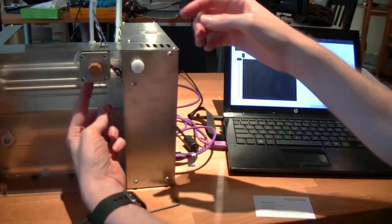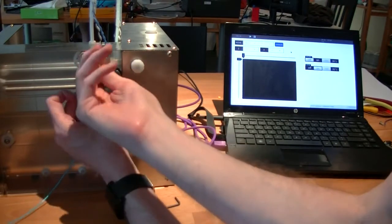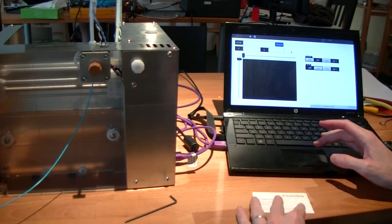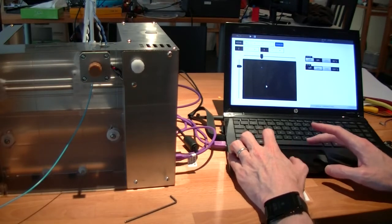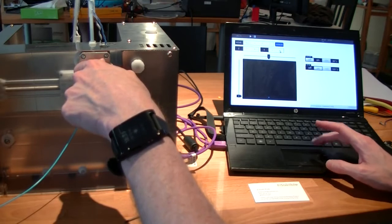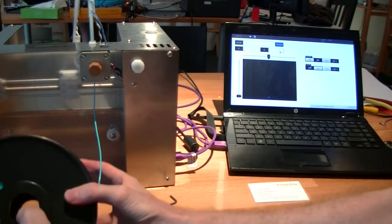And then what you're going to do is the opening's just directly below the feed tube. So just fit it in right in there. And then you should be able to rotate it clockwise to get it started. And it should just go right up. Now, we've already dropped the bed down, so I'm going to push the hot end out towards the edge. Now, you can feed it forward. There is a command line for load and eject, but it's a little bit buggy right now.